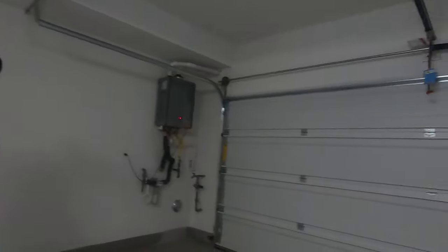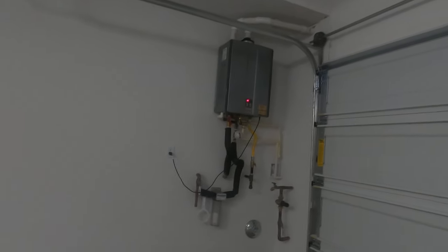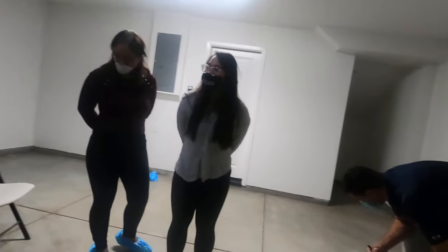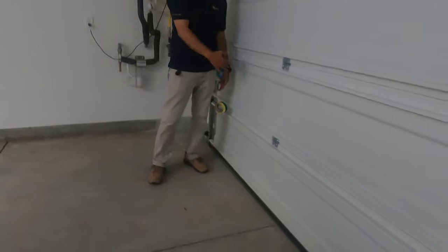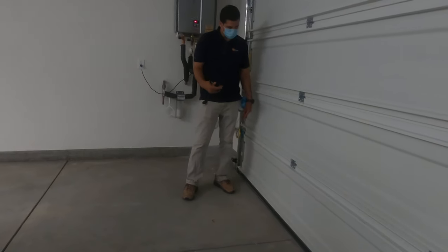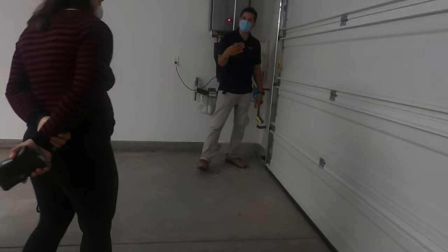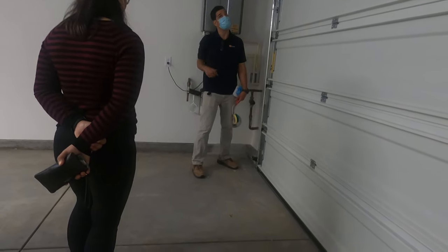The second sensor on the garage door opener: you see those two sensors down below, one on each side? Those are also for safety. If a child were there, they would sense something in the opening where the door is going to come down and it would stop. Sometimes people bump trash cans or boxes, and if they misalign the sensors, the door won't close.